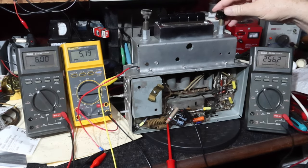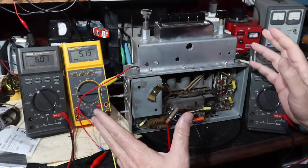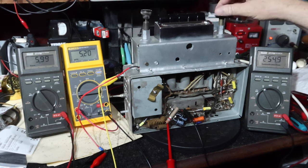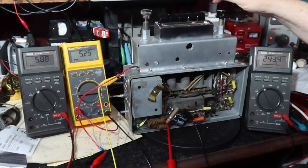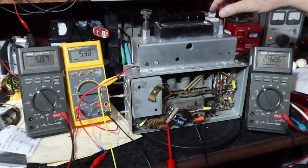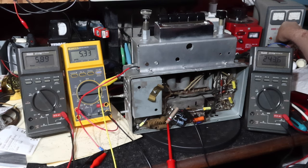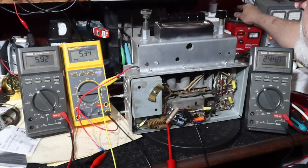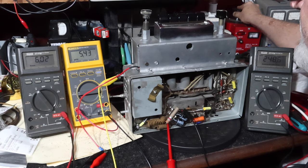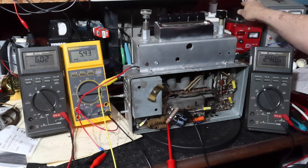Okay, I've had this playing for 4 hours, so it's all stabilized. This seems to be working just great. I'm going to go through and look at what the voltages are. So I'm going to pull the signal out, tune it off station, and we'll turn the volume up if we want to, and then we're going to correct the voltage. I have a little bit better control on my Variac. We're just going for 6 volts. That's close enough. Okay, so we're at 6 volts,